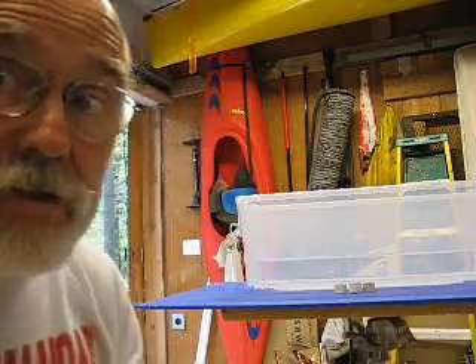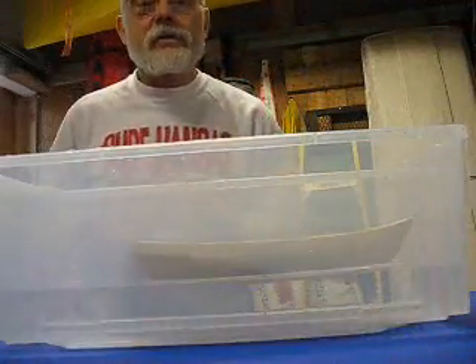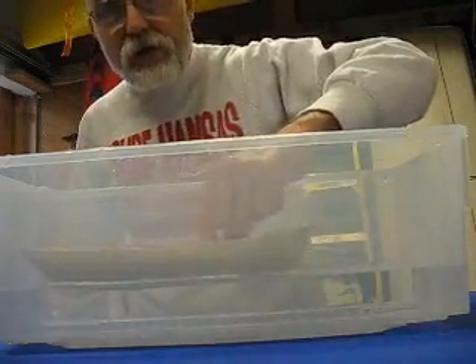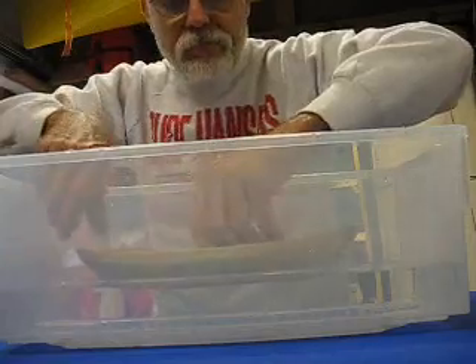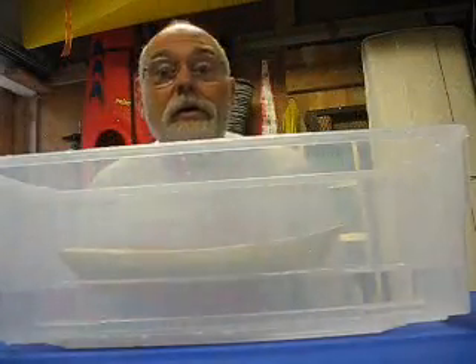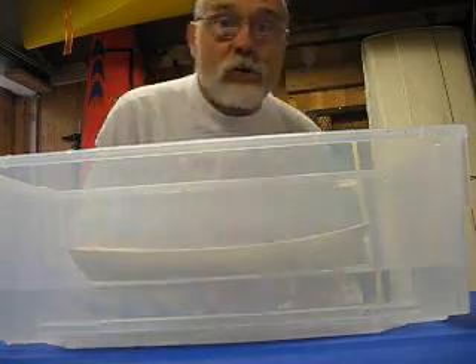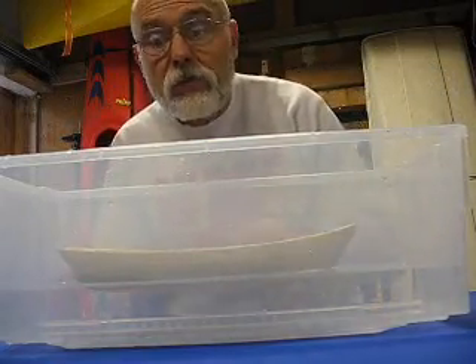It's going to be kind of like a double-ender but not quite. I always start out with my single rower first, and that's going to be my super-size guy. I can't put him up in the front because then the bow is going to set down, and I can't put him too far in the back because then the stern is going to squat. I have an idea that around the beam is going to be pretty close to right on the mark. Setting into the water there, the V in the stern is just touching the water with one person and I'm still only riding on the bottom two panels up in the front. So we've got our one person there - let's see what happens when we throw in a second person.